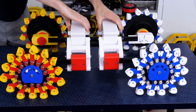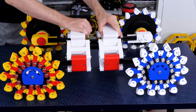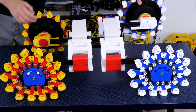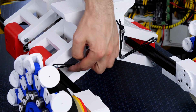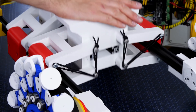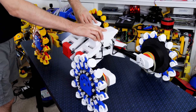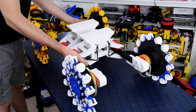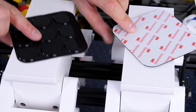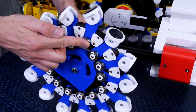Here it is with all the wheels attached. I've used some bungee cord to make the suspension — you can see it bends all around, which should ensure all wheels are touching the ground for traction, as well as conforming with the ground along with the pedrail wheels conforming with objects to climb up. It's bungee cord tensioned on each one to act as suspension springs, nicely balanced in the middle. A few people previously complained I didn't have rubber feet, so I bought 3M stick-on rubber feet and stuck those to all 56 feet across all four wheels.